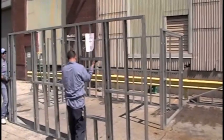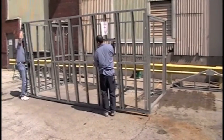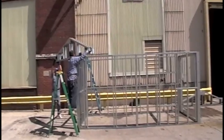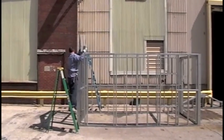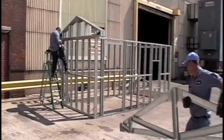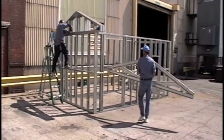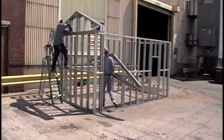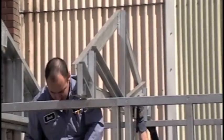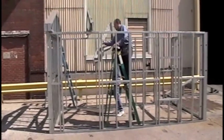To assemble one of these units, all you need is a couple of clamps, a cordless drill, and a ladder. As you can see, the truss on the end of the building is double truss for added durability. This shed is not going to fall down in any type of storm. The holes for screwing in the screws are designed right into the trusses and they go right in through the roll former so we can speed the process up during installation.